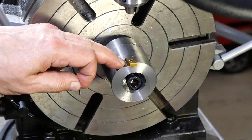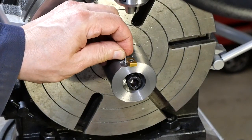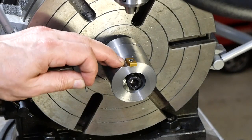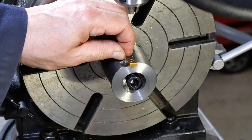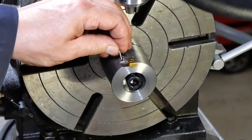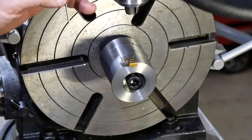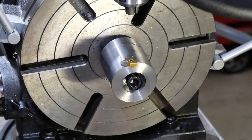So what I'm planning to do, these are truly 2mm. Now I did a bit of experimenting, and if I drilled a 1.93 diameter hole, which I think was a number 27, something like that, then these things are quite a hard push fit into the thing, and they won't come out. So that's what I'm aiming for. But if it isn't in the right place, it's useless. This is a long 2mm dowel pin. I put it in and with this set on the correct location, we'll see if it's just nicely tucked against the side of that insert.